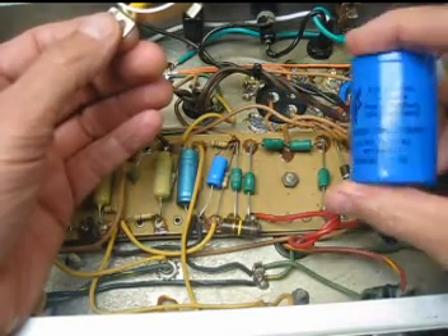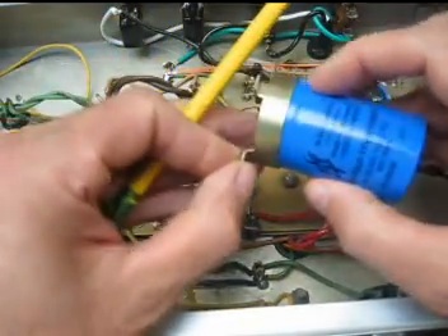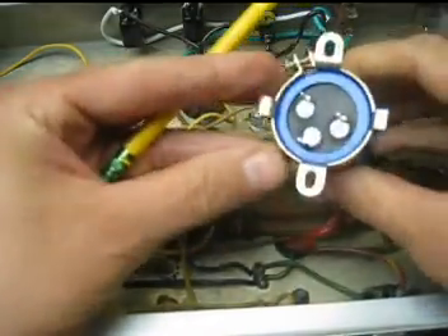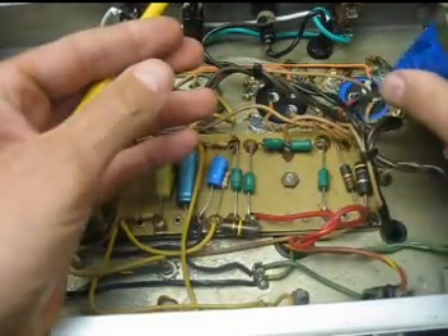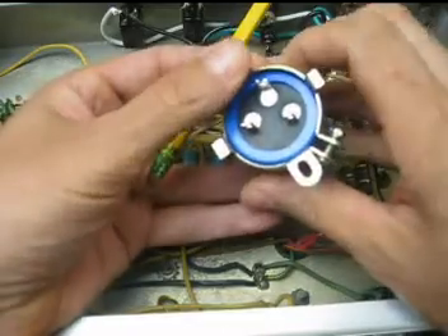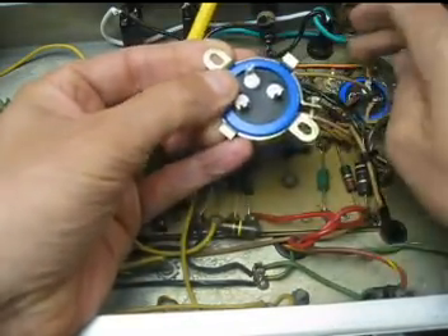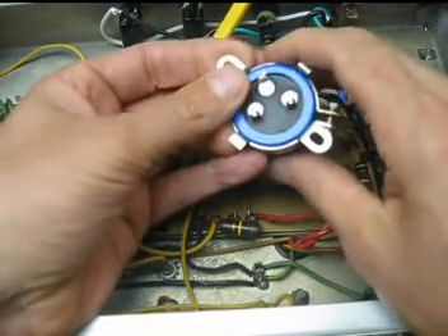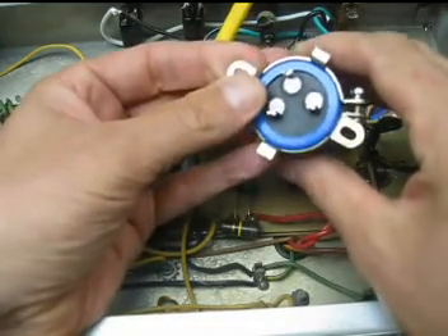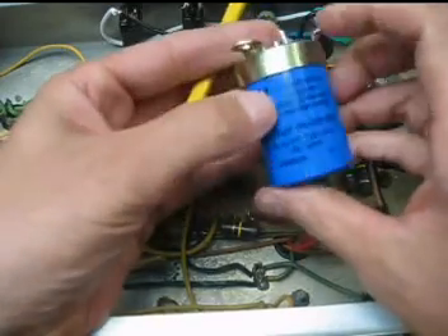You will not be able to find any 40-40 capacitors anyway. The clamp goes on, unscrews, and slides on. If you get your holes right, you line everything up and clamp it back in place. The nice thing about the clamp is you can replace the filters every 10 or 15 years or so without having to desolder those connections or those grounds. And hopefully Marshall-style filters will be around for a long, long time — they certainly made enough amplifiers.